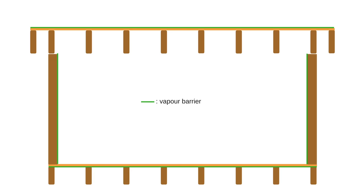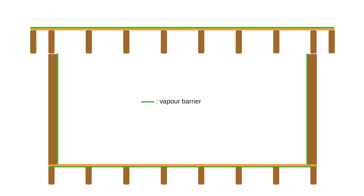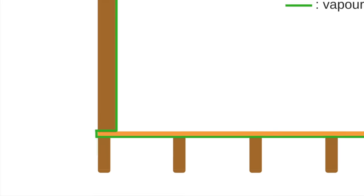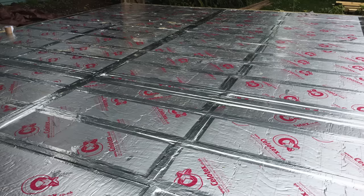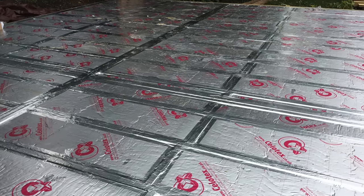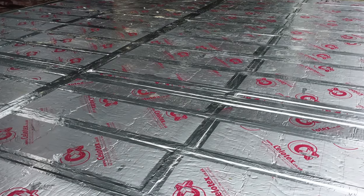Here is a more accurate representation of where my vapour barriers are in my build, and there are some gaps. If you have the combination of a concrete floor and cold roof, then you have the opportunity to create a really tight envelope, with the exception of holes for downlighters. You shouldn't put down a vapour barrier on top of ply, OSB, or chipboard, but if you use polythene under the ply, you can wrap it under the walls and attach it to your wall polythene. In fact, if I could go back, that's exactly what I would do, as I found out that the aluminium foil only works to radiate heat back into the building if there's an air gap of a few centimetres. But hey, I'm learning.